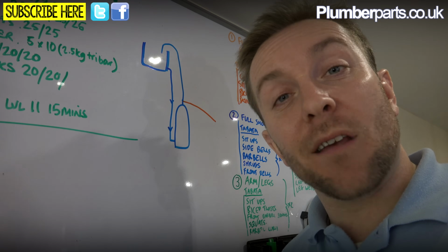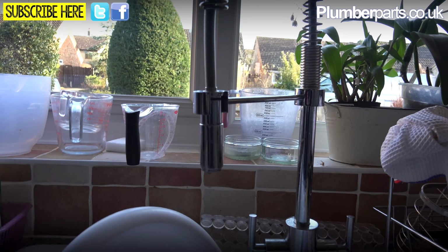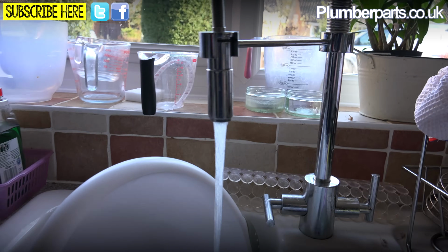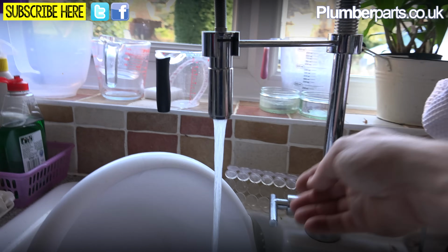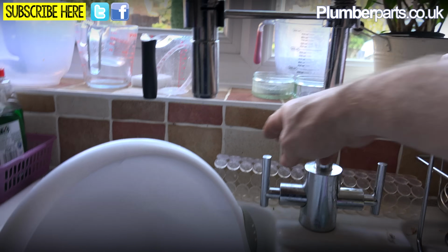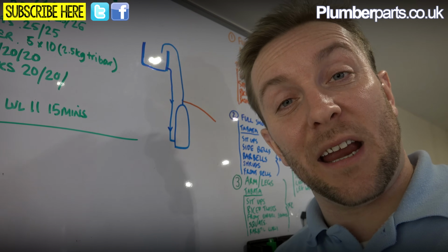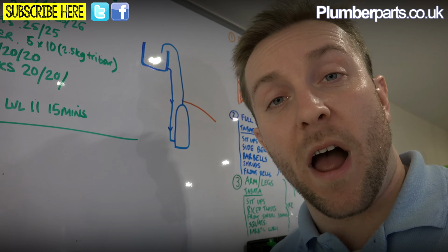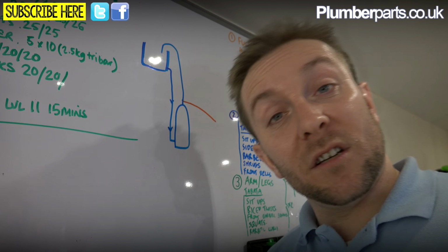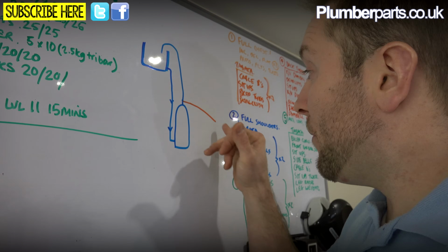Now the problem is pretty much this. All the hot taps on this system basically just wee out like that, which is not good enough. We want them to come out with some sort of purpose in life. As you can see there, the kitchen sink that's miles away is just piddling through when it comes to hot water. So what we're going to do is pop a single impeller shower pump on this outlet here.